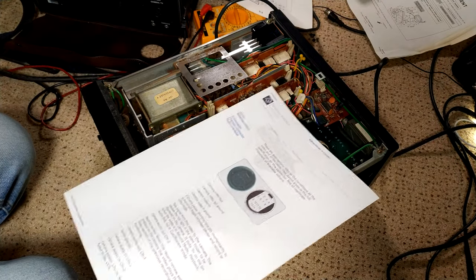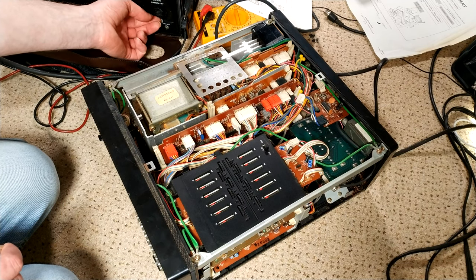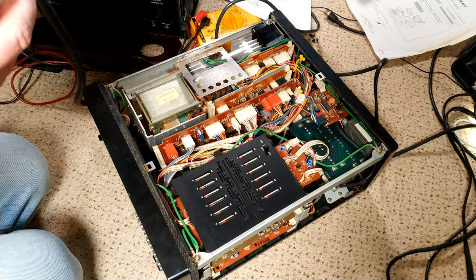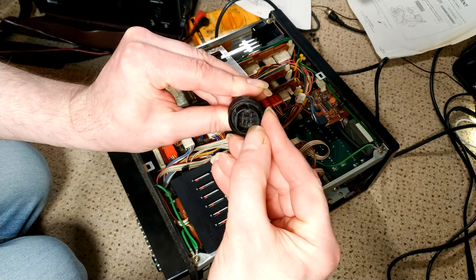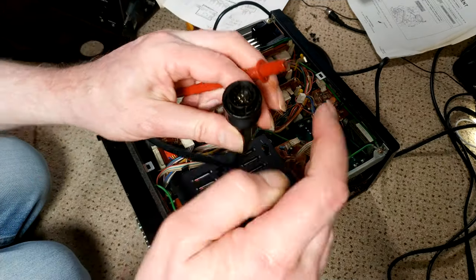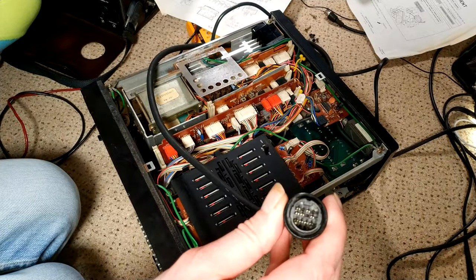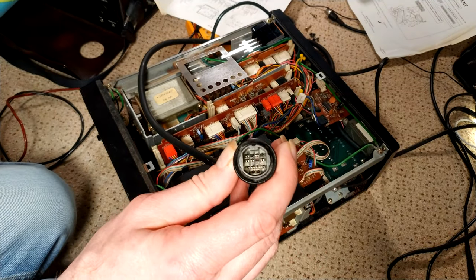So that threw me a bit as well. What we found, knowing that, is that we have 13-odd volts coming out of pin 13 on here, which is actually on the right-hand side, not the left-hand side. The left-hand side is ground, pin 14. And the corresponding pin here, pin 14, which is that one on the right at the bottom there, is ground, and that indeed checks out. We can just prove it. So if I put that in there, Lils is just touching that on chassis. So that's ground. That proves that it is a mirror image. Basically, this lines up with this, and if you're looking at the machine, it's flipped. So yeah, that suddenly makes sense.